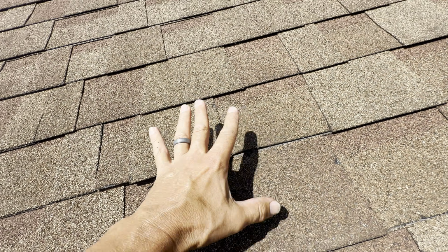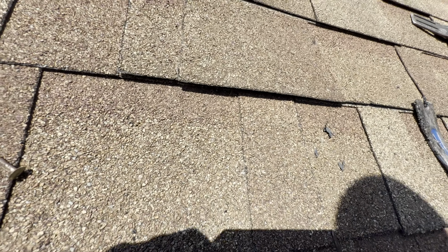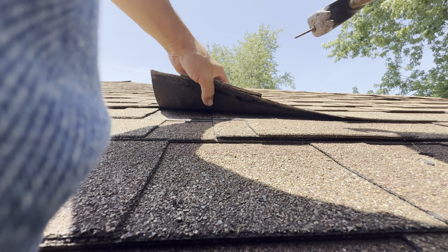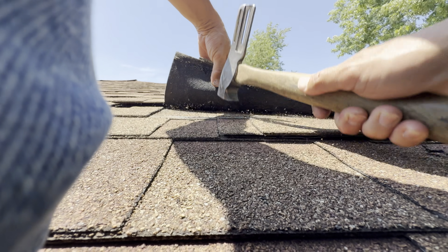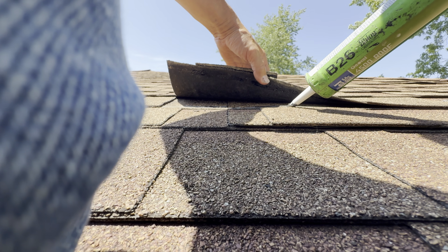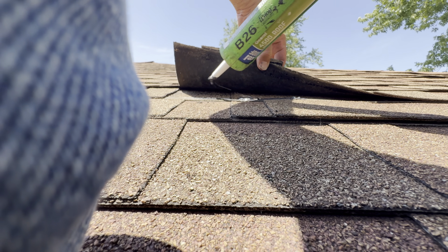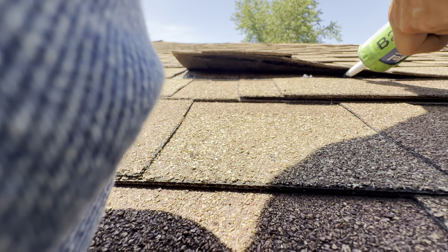All right, if you left it like that, if water dripped in the hole, it's gonna come out on the aluminum. Not a big deal, but we're still gonna address that. Next thing we gotta do is nail this back off using the AJC mag hatchet. Link in the descriptions down below. Tap that off. Try to squirt some sealer right down in that hole. Seal that hole. Couple dabs anywhere you split the seal strip.